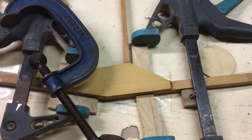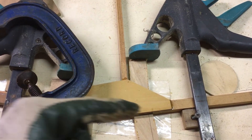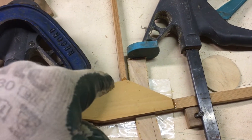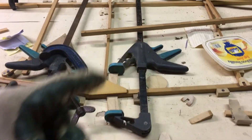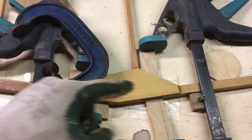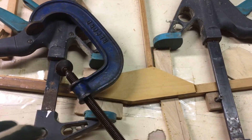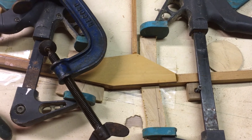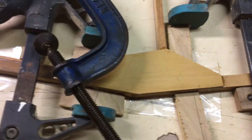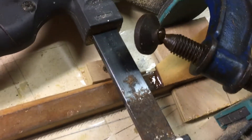Well, that was quite an interesting little bit of stuff. Inside we've got that kind of wedge-shaped piece, and then this part coming down, and then on top is the plate that sits over the top. This slightly strange arrangement is so that I can apply pressure to the little wooden wedge bit from underneath the gusset plate that goes over the top. So I'm squeezing it together underneath this gusset plate so that the whole thing is going to glue together and the gusset plate will glue on top.